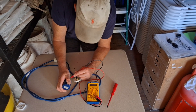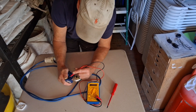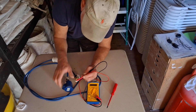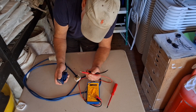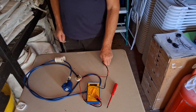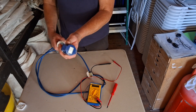If you were doing this through the hole without taking it apart, you could do it if you weren't sure which is which. On these they're not marked up — they are on a plug where you'll have live, neutral and earth on the outside. If it didn't work and you swapped it around and it did work, then you'd know it's correct. But I always find it easier to just pop it off and check it that way. The fuse is right, the wires are all okay, and that fly lead is good to go.